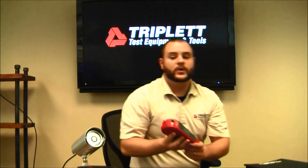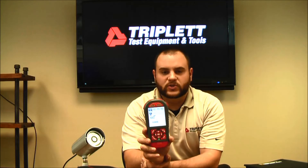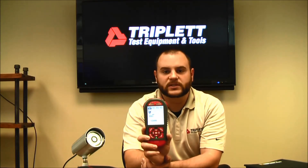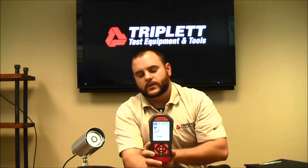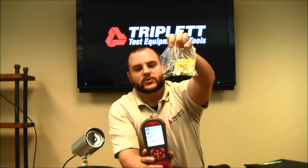That's a quick overview of all the different tests the new LV Pros can do. The distinctions between the 20, 30, and 30SR: the 20 doesn't have much of the PoE testing, the alarm or telephone line voltage testing, or the analog camera voltage test. It also can't save reports. The 20 does not come with the additional adapters or remotes that the 30 and 30SR include.